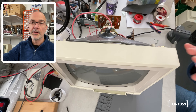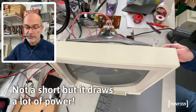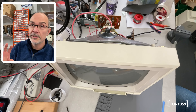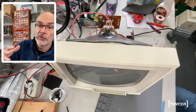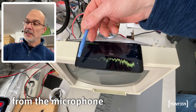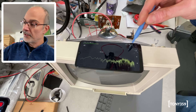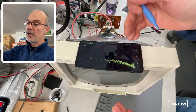I've got the monitor plugged into my isolation transformer, and I've disconnected the degaussing coil, simply because it acts like a momentary short and my isolation transformer and current limiter won't like that — but it's totally fine. Now I've got a spectrum analyzer, which is software plotting frequencies from low on the left to high on the right. If the horizontal transistor is working — which is critical for the operation of a monitor — I should see a 15 kHz peak near the upper end of the scale, which I think ends at 16 kHz.